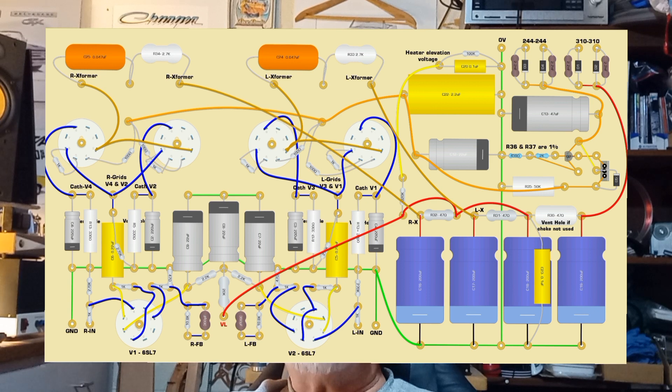It's relatively simple to do this. You can print out — by peeling away some of the layers, there are options to peel away the layers just where the turrets are going to be — print it out and use it as a template to mark with a punch the holes where you need to drill in your board material.